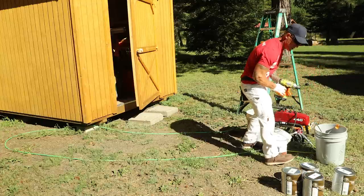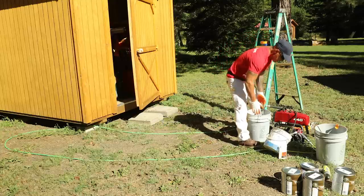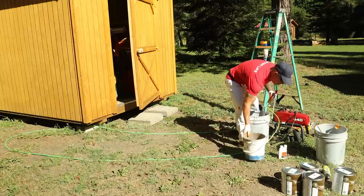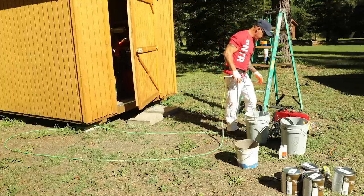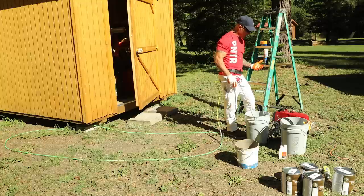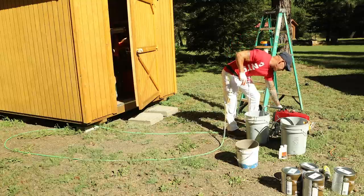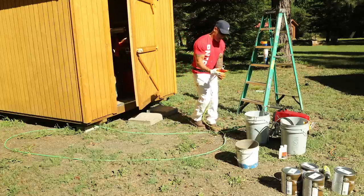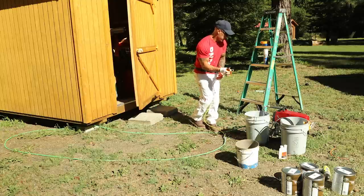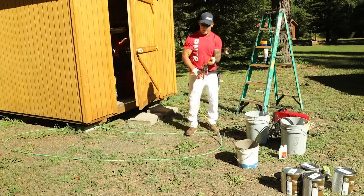I did forget one key tool — I'm working up in the mountains and it never fails. At another job site I left my cardboard shield holder, so I'm going to improvise and make one. Sometimes you just got to do what you got to do. Now I'm going to be spraying this stain. I don't need very much pressure — I don't want a lot of overspray. I'm not trying to create a fine finish because I'm going to be back brushing and back rolling the whole thing. I'm going to run my pressure at around 1,200 PSI at the gun. I've got a 515 high production Titan tip on here — I don't need anything special. An HEA tip would be ideal for controlling overspray, but I'm going to see how this tip works first.